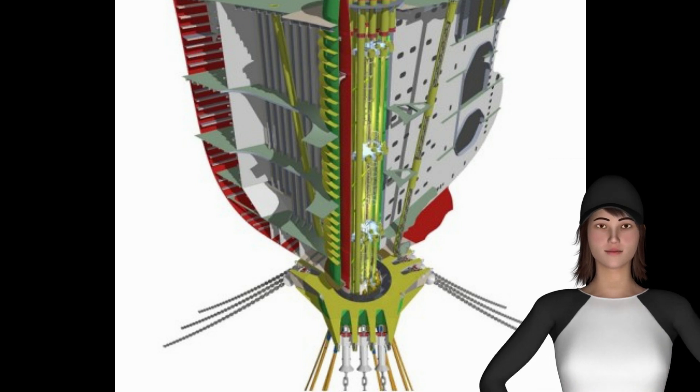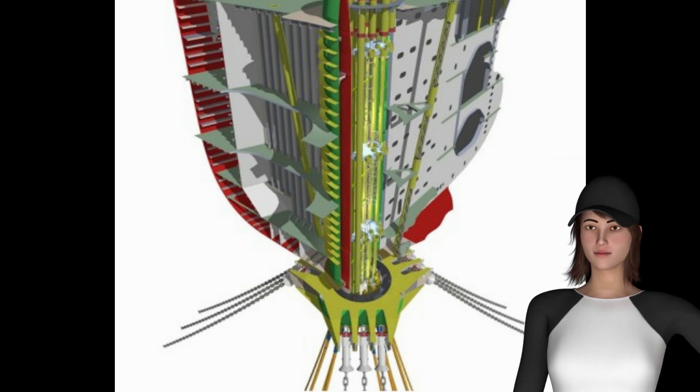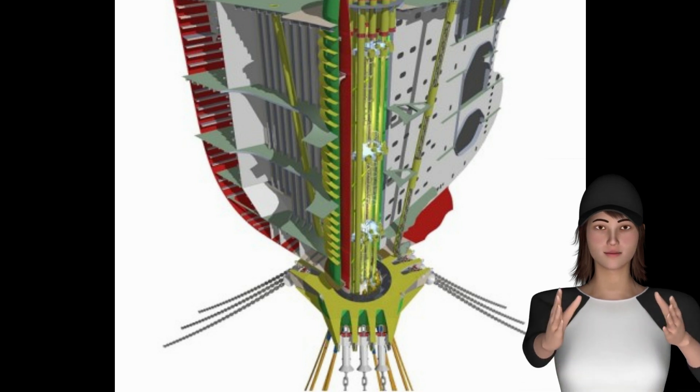The highest deck level of the turntables provides space for the swivel stack, which transfers fluid and electrical power to the turret access structure that is located on the vessel main deck. This access structure also provides support access to the different turntable decks.